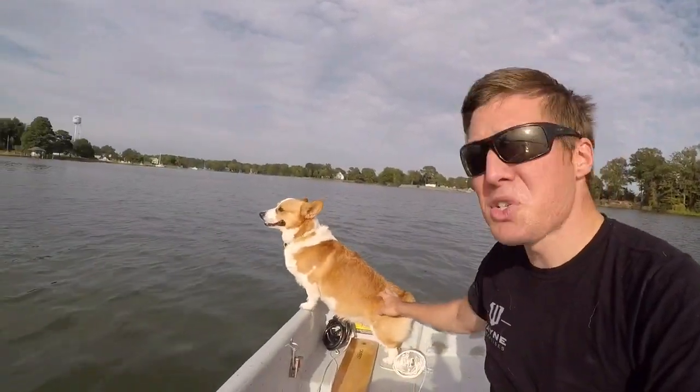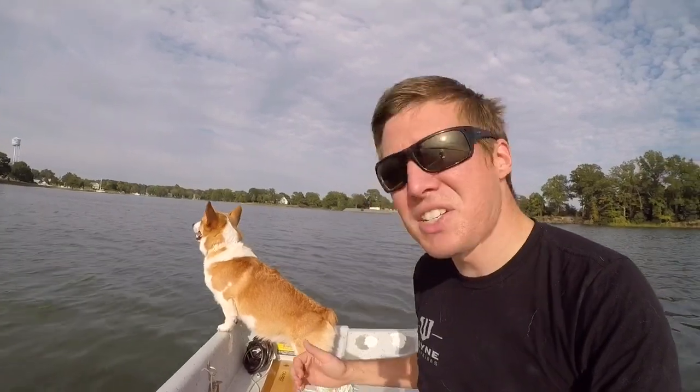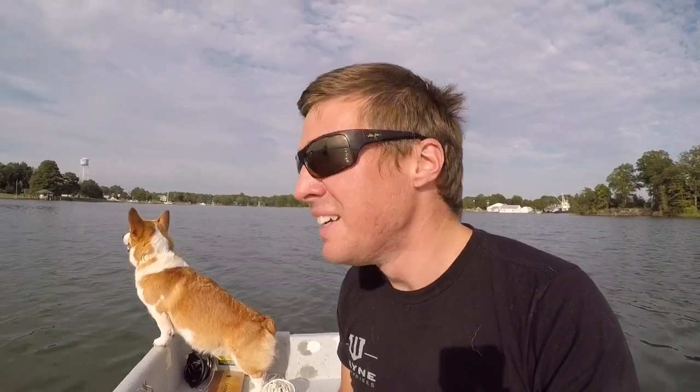So I'm going to take Morty to shore, and while we're doing that, I'm going to sound the bottom in the direction where we'd like to get out of the way of the channel, where all these boats are coming through. It's not a marked channel, but it looks like the locals are using it as a channel and have made it very clear that we're in the way. So we're going to sound it out and see how much further out of the way we can get with our deep keel.